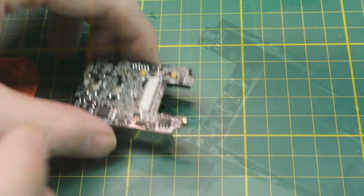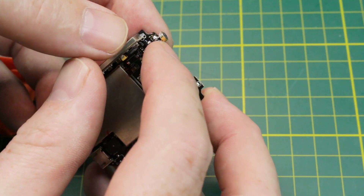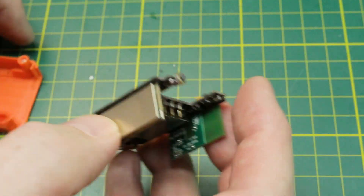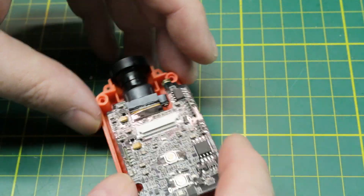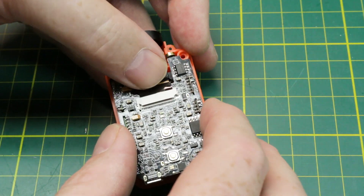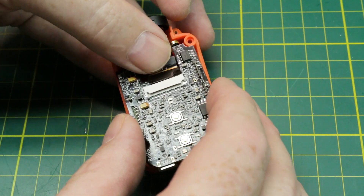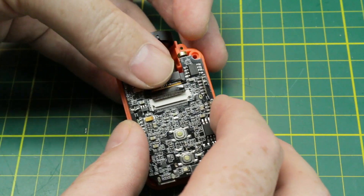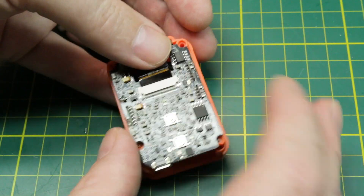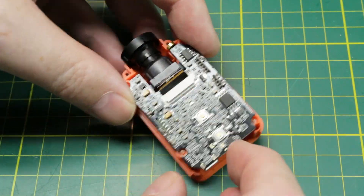These 0805s are a perfect fit — it's just like it was meant to be there. If you want to take your meter and measure across, you should come up with around 250 ohms to make sure you haven't shorted it. If you get zero or about one ohm, you've shorted it and you better fix it. Assembly is just as simple as reversing the disassembly. Slide it into the case, slide your ribbon in, put the retaining clip on, then put the screws in. Make sure you bring the ribbon in nice and level — don't kink it — and it should slide in with zero force, just floating right into its little home.